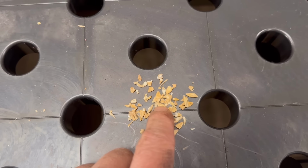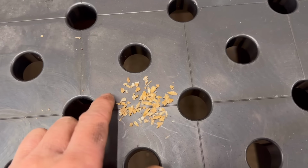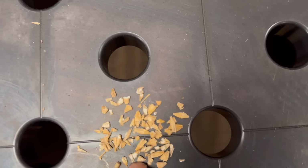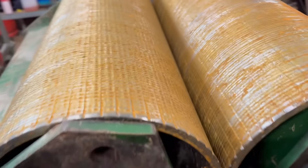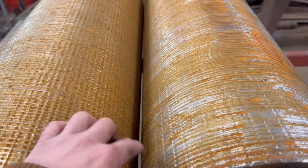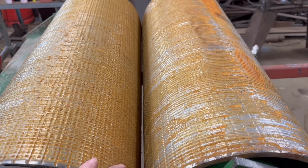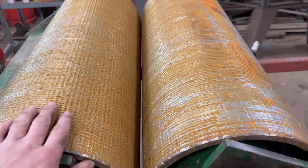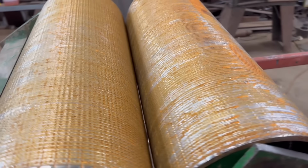So it breaks the grain open, and if you fed cattle whole grain, they wouldn't be able to digest it, it'd go straight through them. So you have to break it up like that, and then they can digest it. But the trouble with these now, they're that worn, it's letting whole grains through. So they're having to feed the cattle a lot more grain because they're not digesting it, it's just passing through them. The grain that gets through here is not getting digested.